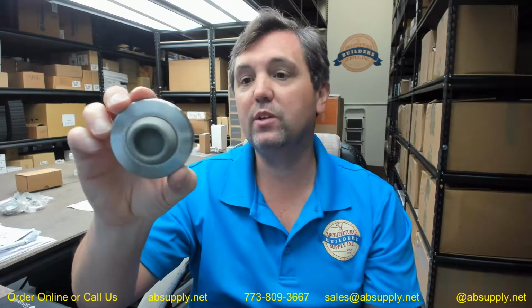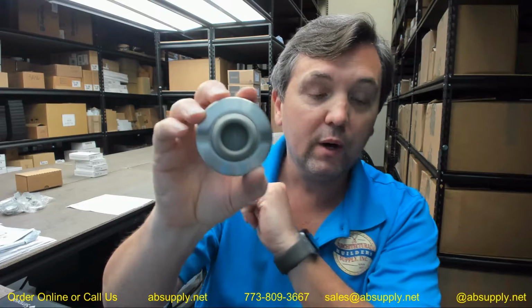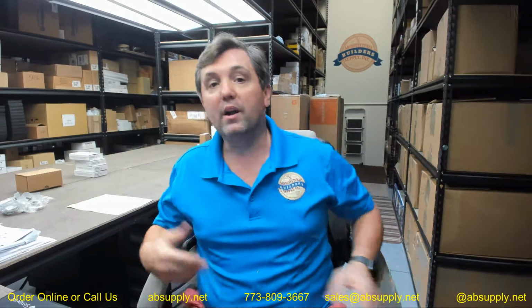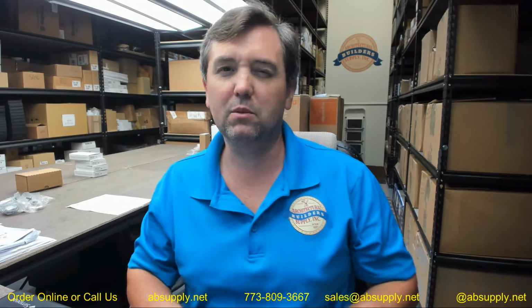The reasoning is you would use a concave when you have a push button, like an office function or a privacy function. You don't want to have an unintentional relocking of the button every time the knob or lever hits the bumper. You would want that push button to go neatly inside the hole. Now there are functions of locks that will automatically unlock that push button when the latch bolt is depressed, but not all locks work that way, and in fact I would say the majority of locks do not. So use concave when you have push button functions.